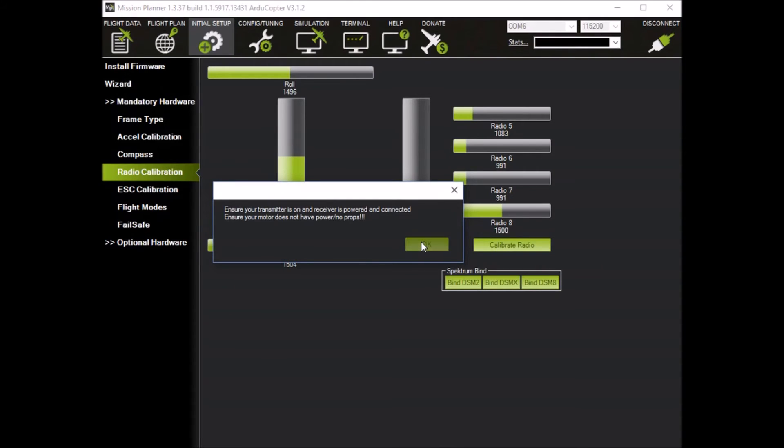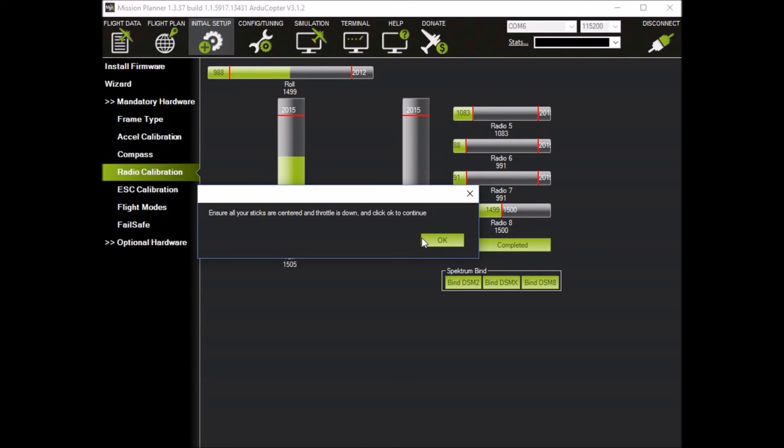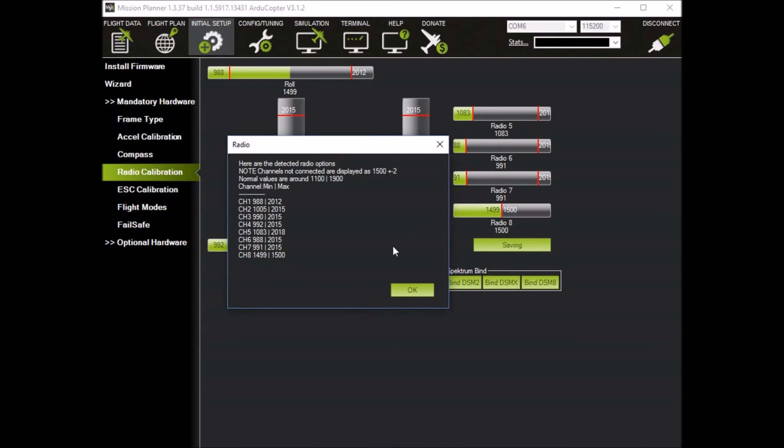In other words, doing a flip or something else. I would disable switches 6, 7, and 8 in your radio, and then proceed to do the calibrations — making sure that you're going to all the extreme values and then clicking done. Check your switches, and just to be safe, deactivate 6, 7, and 8 so that they're not programmed for something you don't want.